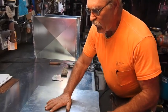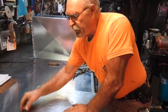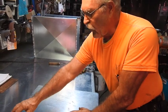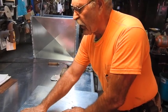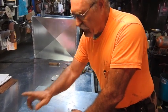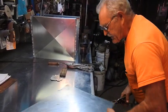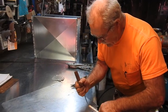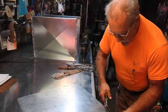We went ahead and notched. We marked a quarter all the way around the three sides because of the Pittsburgh on the three sides. We've got two and a half inches marked so we can fold in the two-inch and half-inch fold over. Now you've got to think about this — whenever you fold this over, unless you notch it properly, those folds are going to come into conflict with these folds up here. If you think a little bit ahead of time you can make this to where it will fit right in and lend stability to the box if you notch them correctly. So we cut the quarter-inch corners off and we'll go ahead and notch that quarter right there, take it all the way down and mark in two inches off of that edge on both sides, but don't cut that half inch off.